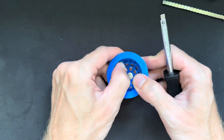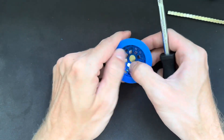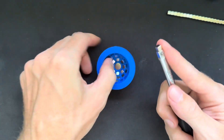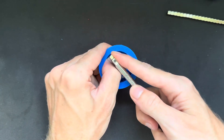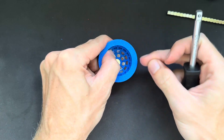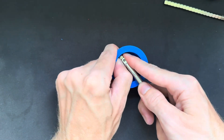With the bigger arrays, I can honestly say it is quite tricky, because 8 or 10mm cube magnets are really strong, and the total field of the array is also strong. The magnet will always be attracted to the others and just doesn't want to go into the hole. It's like the force of the entire field prevents it — only when you push it completely in will the field push the magnet inside; if it's not fully in, it's drawn toward the center.